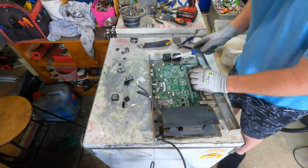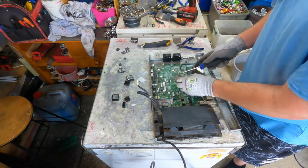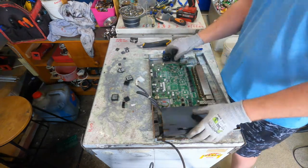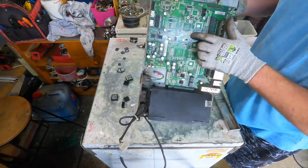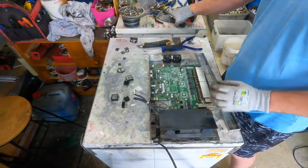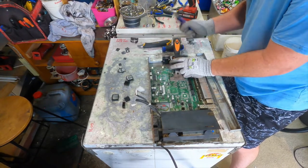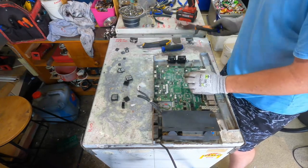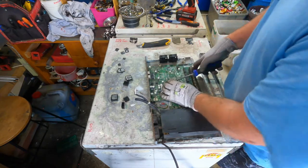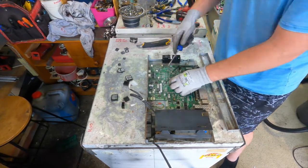And now we'll attempt to remove, hopefully this works, these gold band crystal oscillators. See, if you don't get it right, you end up risking just popping the top of the can off and you leave the base on the circuit board itself, which is a little bit frustrating because now I'm not too sure how I'm going to get that off. There's one success.